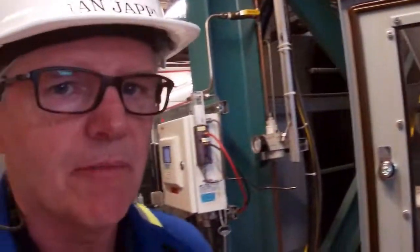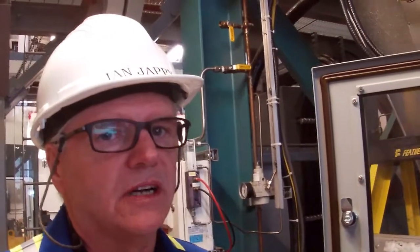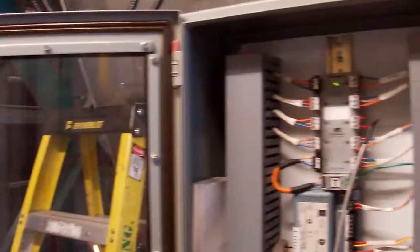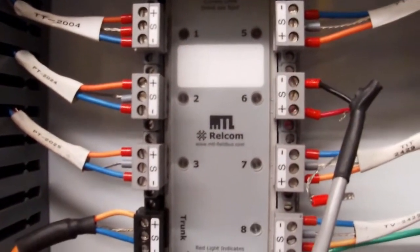So basically what's going to happen is they're going to have a drain. It's like a current protector or a current limiter that you'd have on a DCS. Old DCS for 4 to 20, they were always fused before, right? And so you had to be careful when you lifted a wire from a transmitter. I'm thinking about an old Fisher Provox, for example. You pop the fuse. Well, now they have current limiters on the DCS system, so you can take the ends of the wires and dead short them, and they've got a current limiter. Something similar to this, having a segment protector, you're going to have a current limiter. It's not going to affect the other devices on the segment.